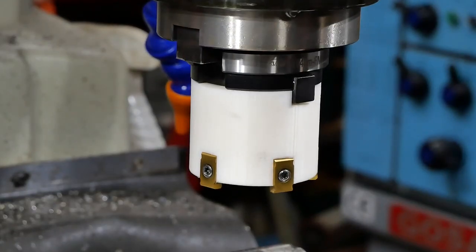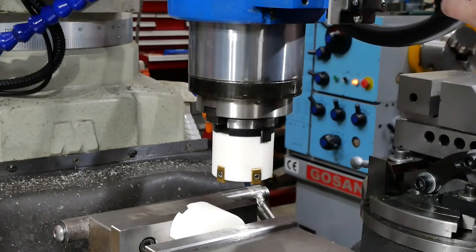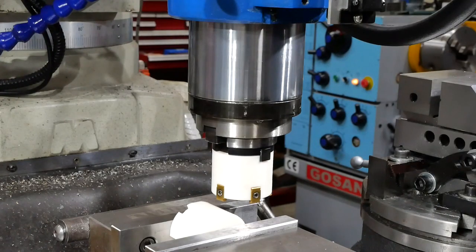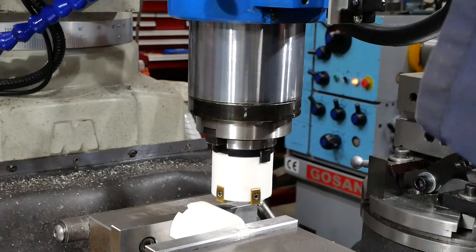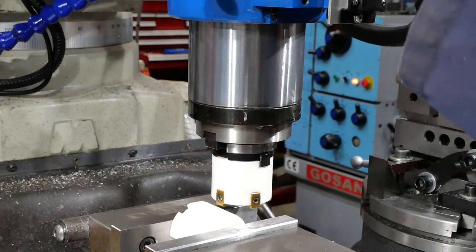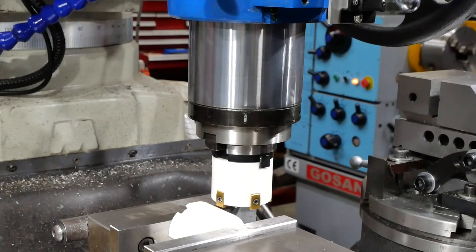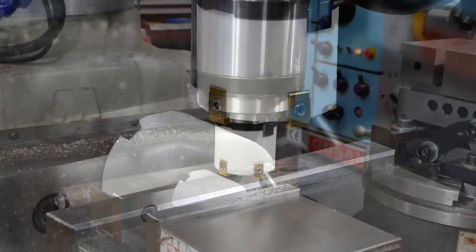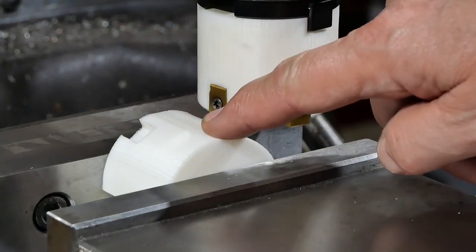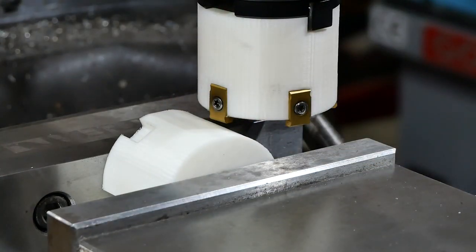And then, of course, I thought, well, if I'm going to do that, I might as well see if it actually works. So I've got a bit of one of the stepping stones, shall we say, mounted here. And I can happily report, because I did a quick try before, I don't want to embarrass myself too much on TV, it actually worked surprisingly well. There we go, that's going to be a 0.2 millimetre depth of cut. I did take a cut earlier, so this one might well break through the skin into the, because this is hollow, this bit of plastic. We'll see.